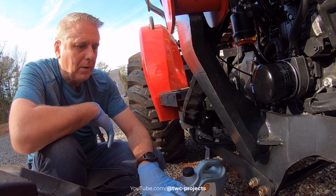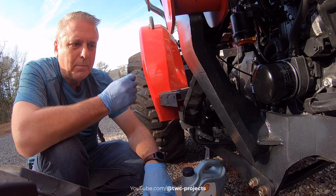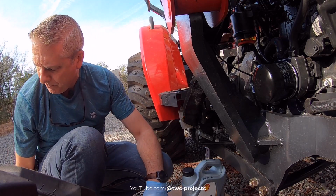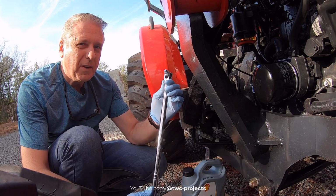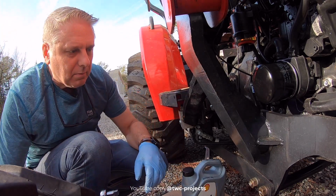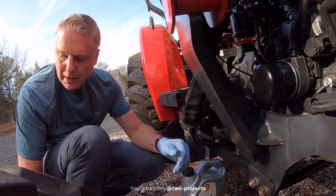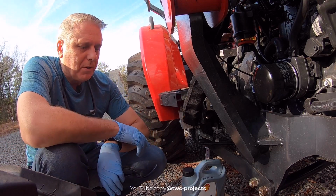Of course, I drained all the oil. There's a few little drips still coming down, but I was too impatient, so then I put the plug back on, hand tighten, not too tight, even though I had to use a breaker bar to get it loose. It felt pretty tight, but I tightened it with a smaller ratchet and putting, you know, a reasonable amount of pressure on it. So I don't have torque specs for these. I'm sure there are some.